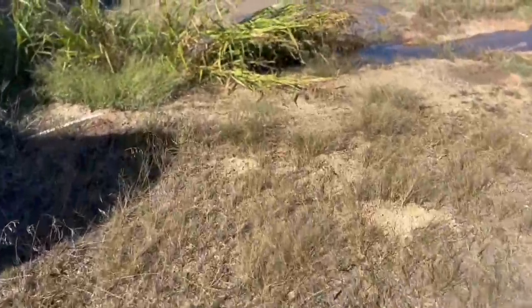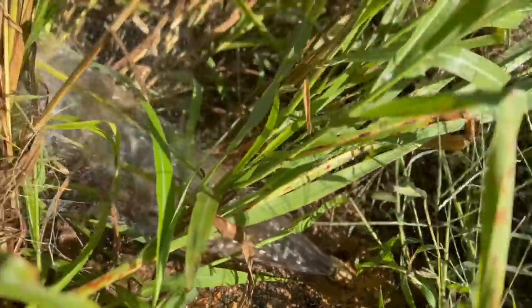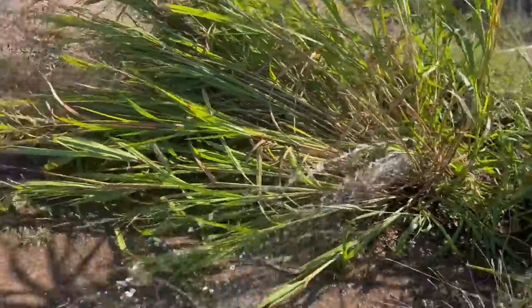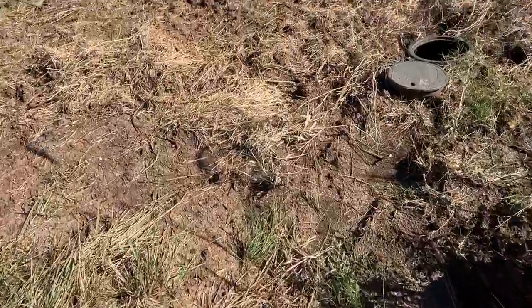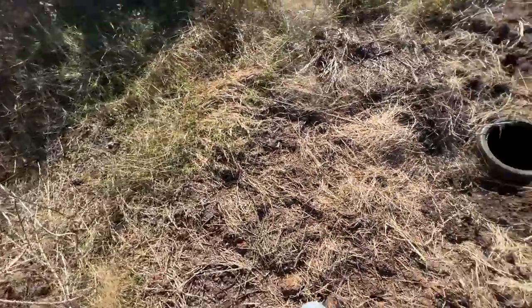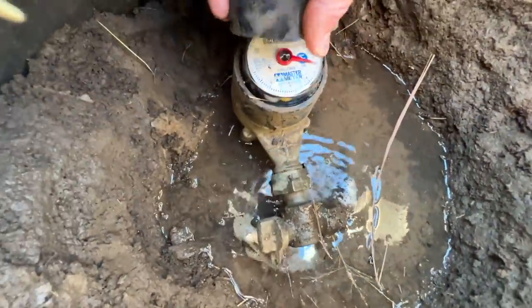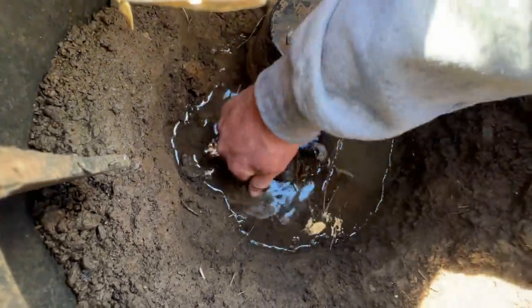Well, trying to locate water, all the water lines. This is what I discovered. That would be a busted line there. So that's fun. It's a nice way to start. I had the rural water company come out to get my water back on. They had to do some new plumbing. That's why all this is dirty right here. So I came in here, turned my meter on, and it's actually leaking there, which is awesome. Got the new smart meter here. They're installing them everywhere for our rural department. I'm going to go ahead and shut this off for now, since we've found a fancy leak.